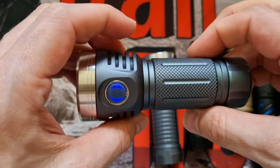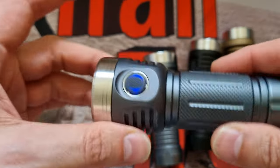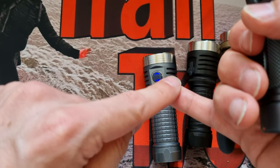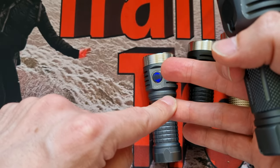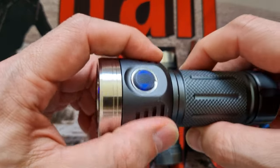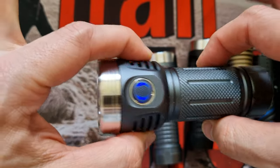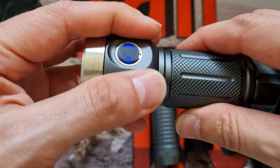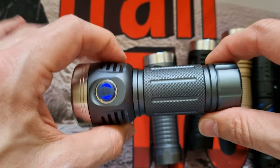For me, it doesn't feel like 5,500 lumens. That could just be two things. It could be the high CRI, you're not getting as much lumens, and the tint Kelvin value is 4,000. In fact, it's below that from my reading. Therefore, generally whiter ones look brighter. It could be a combination of those two things, and maybe you're getting about 4,700. I don't know. However, it doesn't feel like the full amount to me, so I'll mark off a little bit.